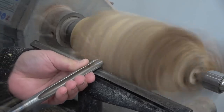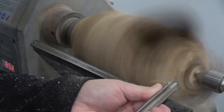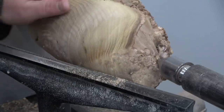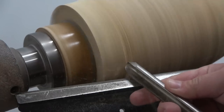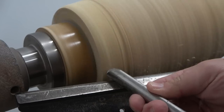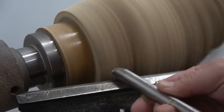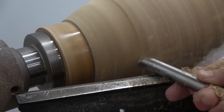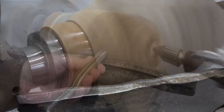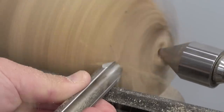While the piece is so off-balance I normally run around 300–400 RPM, and as it gets into a more round shape I bumped up to around 800–900 RPM — and I won't really go any faster than that. I purposefully left this footage in the edit: I'm a left-handed turner and I switched hands this time, and you can see how uneven and wobbly my cut is. I had to switch to a pull cut instead of a push cut, just because of the camera positioning. It was a great eye-opener for how important it is to have the right tool positioning and use your stronger hand — because when I use my left hand to maneuver the cutting edge, it cuts perfectly.